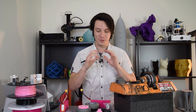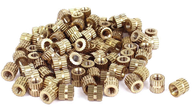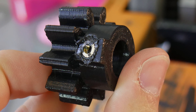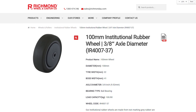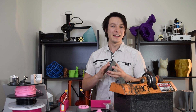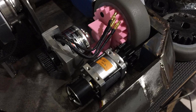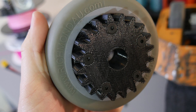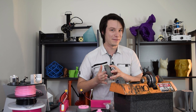Even the strongest plastics won't hold up small threads, so I got creative. When attaching the gears to the output shaft, I used M3 threaded inserts picked up in Shenzhen, melted in with a soldering iron, with some plastic melted back over the top to keep them secure. They worked really well and didn't come off or slip at all during the competition. For the output side, I closely modeled a hub which fitted into the contours of the wheel using a G-clamp, with five M4 screws holding the gear in place. I was shocked at how precise and true these spun despite the kludgy method of attaching them.